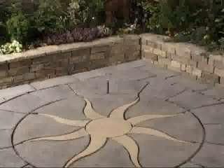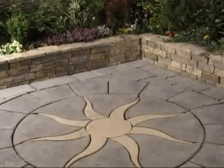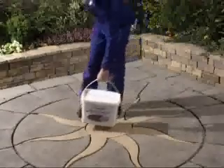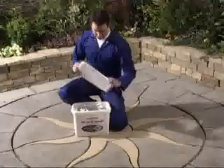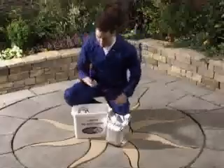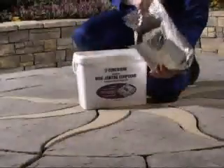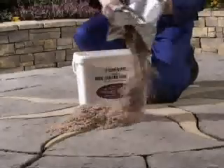Application should take place in clear weather when no rain is expected, and in suitable ambient temperatures. Once the area is thoroughly clean, remove the sealed bag from its bucket, cut open and pour the contents over the prepared paving area. It's recommended you work with one 10 kilogram bag at a time, to avoid waste and any need to rush.